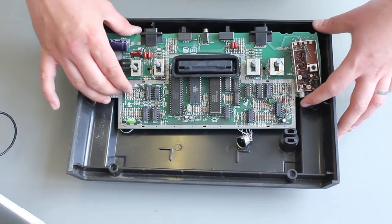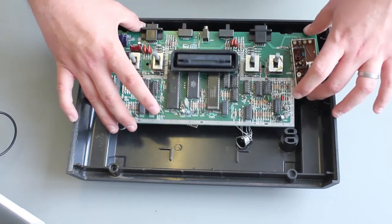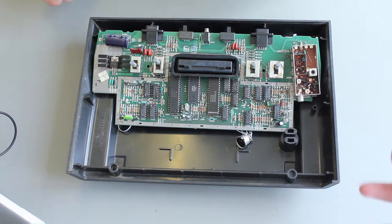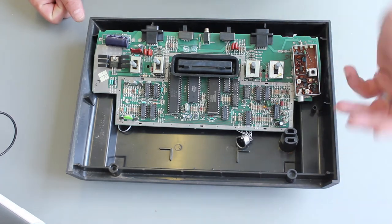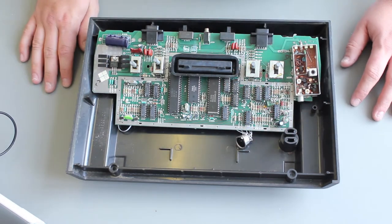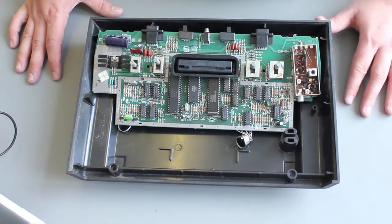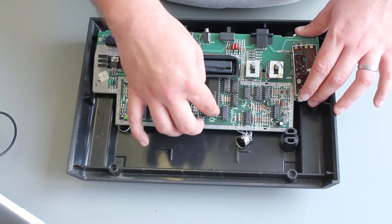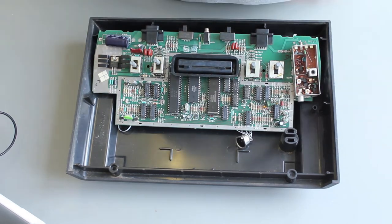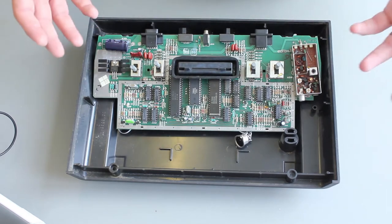You connect your TV via a cable out of the RF can and then you'd tune your TV to receive the signal. We don't really do that anymore — we just plug HDMI in, or in this instance SCART, or component cables, and select the input channel. That makes all of the RF modulation section redundant. So what we're going to do is take the RGB and sync signals directly from the TIA chip, pass them through a buffer and some resistors, and connect that to a DIN cable. That's all we really need to do.